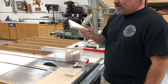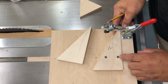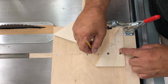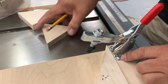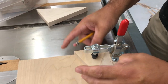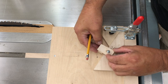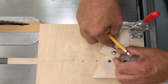So we've got our 60 degree fence piece that we need to put on the sled. Mine's already built so I just ran a couple of inch-and-a-quarter face frame screws down to hold it on, making sure those are in line with the miter runners so they don't poke through the bottom. You're also going to need a De-Sta-Co clamp — this is going to clamp the piece on when it's time to cut it, hold it in place, and be a much safer way of doing it. You'll also need to build a little stop like this so that for the final cut you can use the stop to determine the length of the sides.